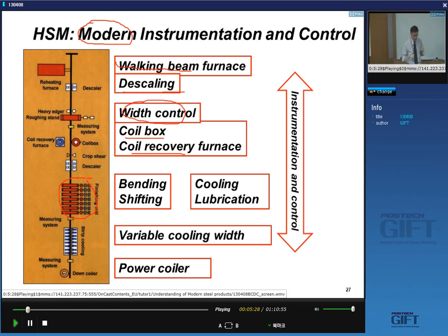In the finishing mill, roll bending and roll shifting equipment is being installed very often. That is to control the strip profile; we'll devote a whole lecture on strip profile. It's to make sure that you have the right shape of the strip, what we call profile. You probably think that when you roll a sheet material, the thickness is the same everywhere. Well, it isn't, and you may not want it to be the same everywhere either, as we will see.